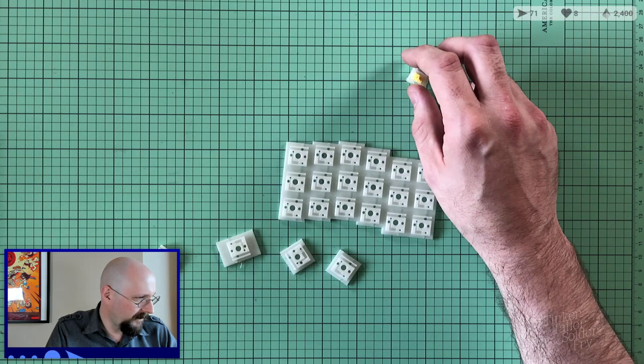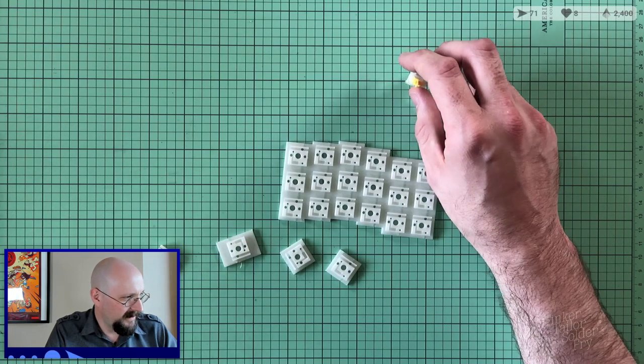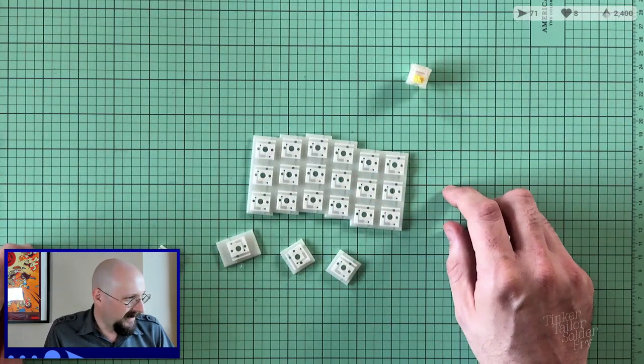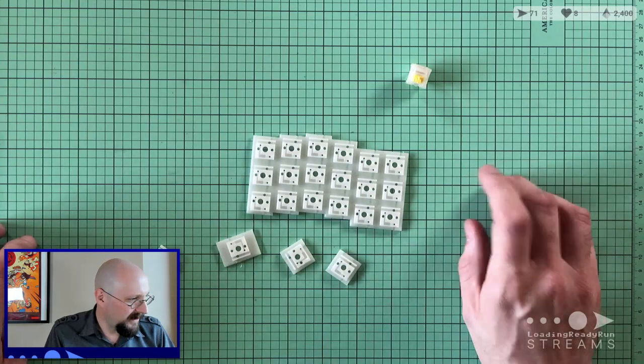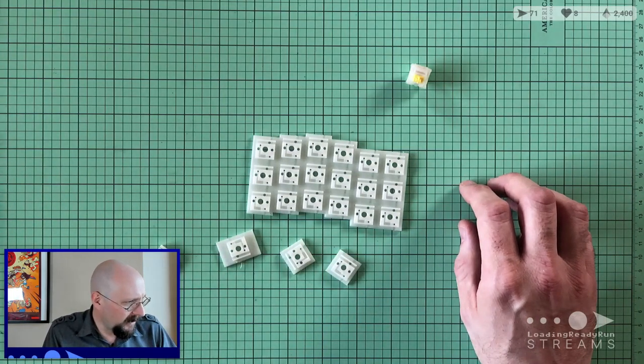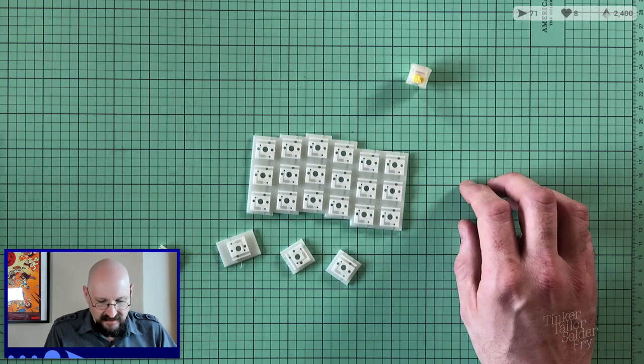So first step, you make the PCB as it is. Then option 2 is optional: you can make the plate and the back plane, and then we're going to measure and cut wires for the rows and columns and press them into the corresponding channels in the PCB.